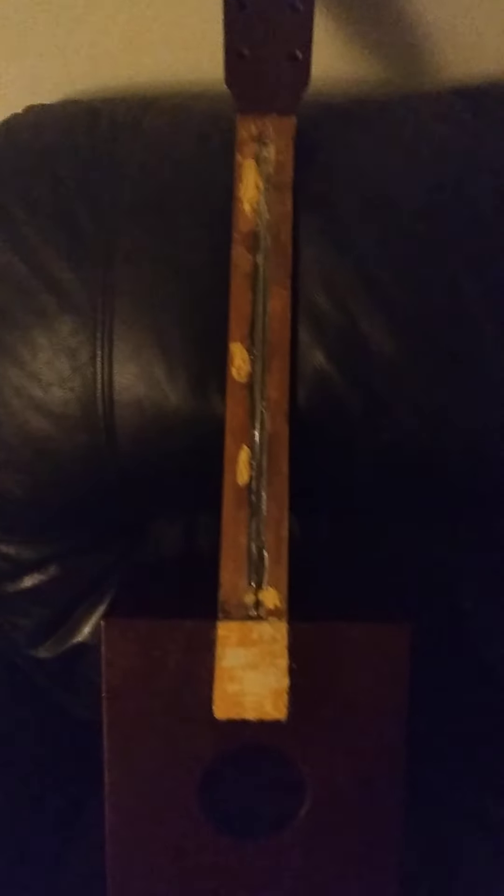I'm going to add some of that veneer or wood down here to make the neck a little bit stronger. That neck on the guitar right now is pretty strong, but anything that makes it even stronger will help it last longer. I'm going to add some thin pieces of veneer and some liquid hide glue — a good amount — and that's going to strengthen the neck joint held in with the dowels.